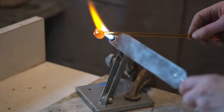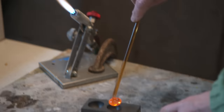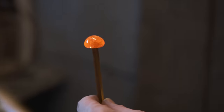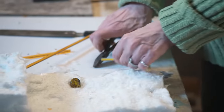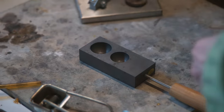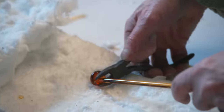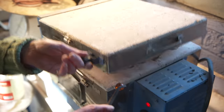There are eight large gemstones on the top of the axe. Creating actual gemstones isn't feasible — it would be too expensive — so they use specialty glass. Lauren does lampwork creating these glass beads. They have a die in carbon that's exactly the right size, so she brings up the temperature and presses them into the die to create that dome or cabochon shape. Before the end she cuts them off and puts them in a furnace to cool down slowly, otherwise they'll break.